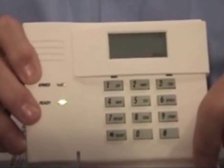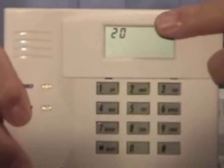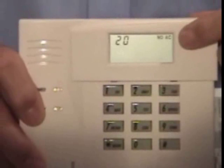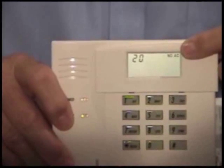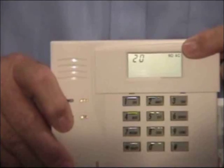Let's look at how to enter program mode with a code. If you go to your installation manual, it will tell you under the section of programming a unique code that you can use to enter program mode for this system. You would enter that code, push key number 8 labeled 'code', and key 0. Now the system is blinking to 0 - that's the first line of user programming, it's ready to begin. Don't be alarmed if it displays 'no AC' in the corner of the window - that's normal for programming mode, don't pay any attention to it.